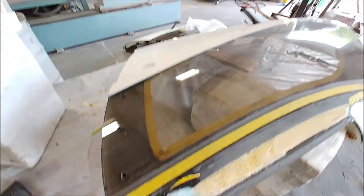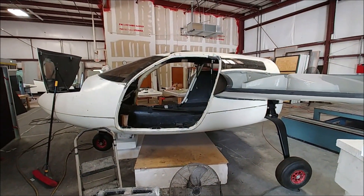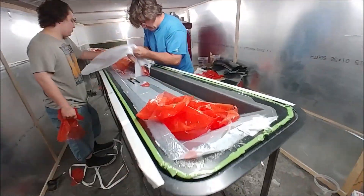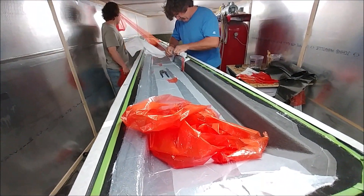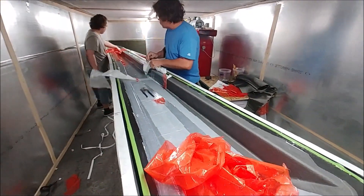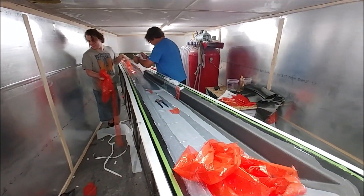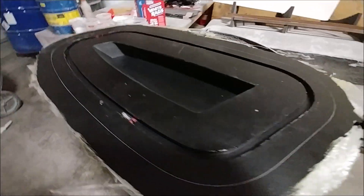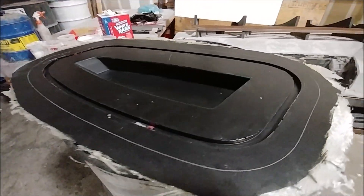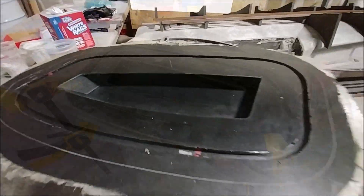It was actually good to have a day off to let my hands recover. Now this is Wednesday morning, and the guys are peeling back what they did on Tuesday. This is the first stage of the layup for this wing spar and as you can see it looks pretty nice — I'm just taking all the peel ply and stuff off. Here's the first of those rib molds for the four-plane: it's been released, had the plug removed, and just needs to be trimmed, cleaned up, and waxed now.